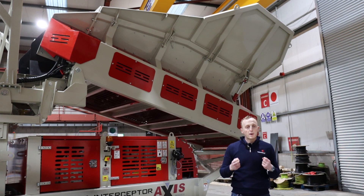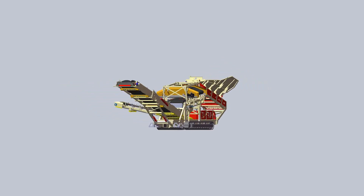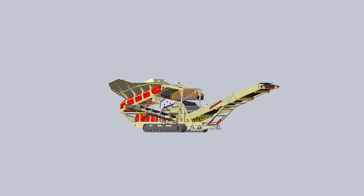A combination of impact bars and impact rollers create a robust feeder module. The hopper can be lined with the customer's choice of wear liner — in this case, lined with 6mm thick ABRO 400. Other options include a heavy duty fall brake system and hydraulic folding side extensions.